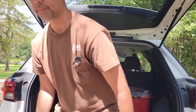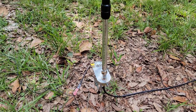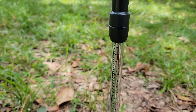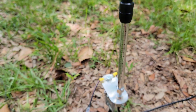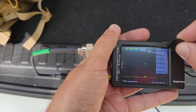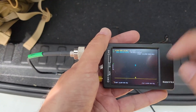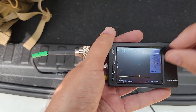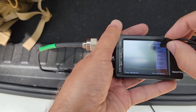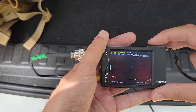So the antenna is just how I have it installed. I don't have anything special going on. It looks like I'm all the way at the top of my graduations — so it's fully extended — for 10-meter radials and some coax. Let's see what our NanoVNA tells us. I'm going to recall my saved configuration. I am at 10 to 1 on my SWR at 14 megahertz, the 20-meter band. So we are way high for 20 meters, but I don't even know where we are to begin with. So let's change our stimulus. This is a 7 to 30 megahertz antenna, and fully extended we are beyond 30 megahertz. Let's go make some adjustments.